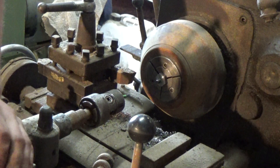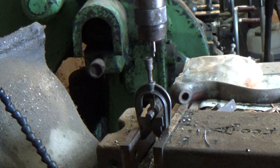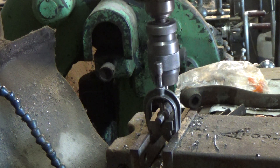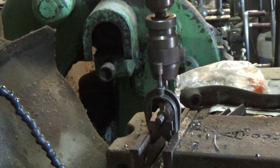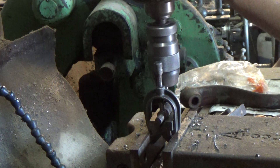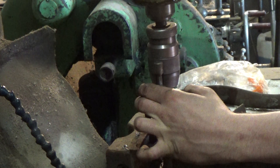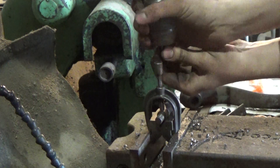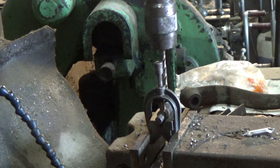And there we go — grease nipple fits on. So I set it up in a v-block with a clamp, and what I'm going to do is centre drill it and then drill it 5.5mm again. Power's on. The chuck is very close to the clamp — this is why it was catching — so hopefully I've marked it just enough. This one shouldn't be as much trouble.